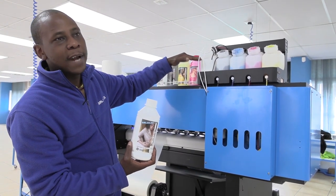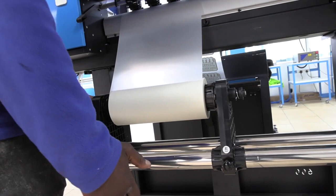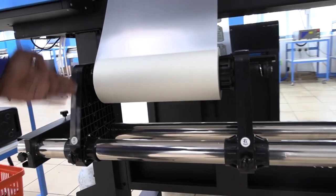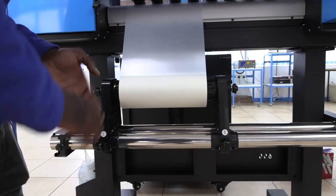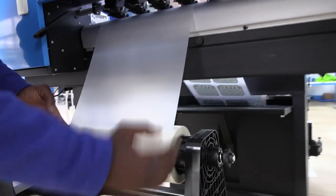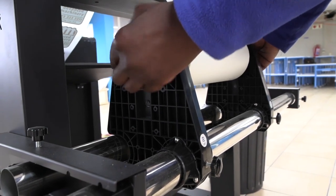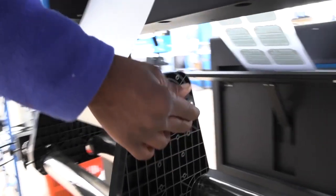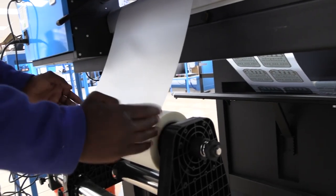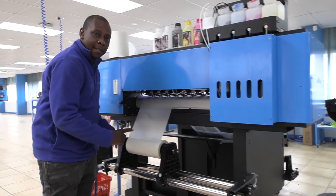Setting up the roll: you will have your left and right props for holding the roll. Normally preset your left side to start just before the first roller, so that when you put in a roll that is 300 or 600mm wide you only need to adjust the right holder. Make sure your tension is even on both rollers so that your material isn't running skewed when it's being pulled during printing. These are the tensioners — make sure they are at even tension.